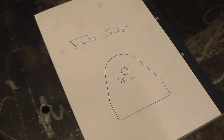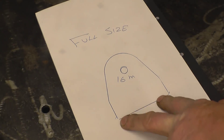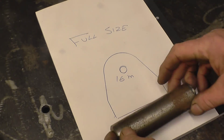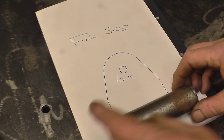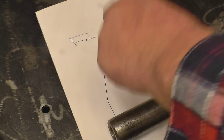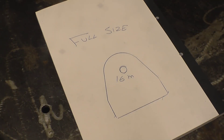I've got a nice little fabrication job to do here, which will give us a chance to use the Artec Plasma Cutter again. Basically I need two bits of plate cutting out that size — I'm going to use 10mm plate. The lad supplied that bit of tube, and all he wants is those two pieces welding on either side, and a pin making to go through the centre. It's some sort of turnbuckle eye. We'll go up to the top shop and see if we can burn the pieces out — I'll have to do a computer program first.